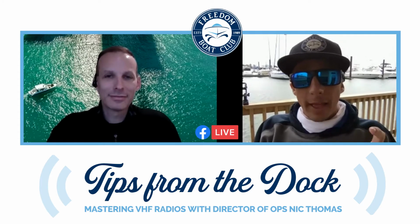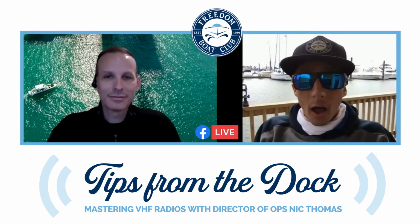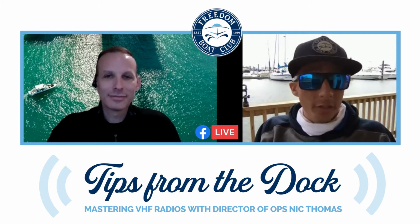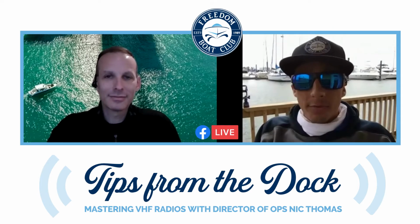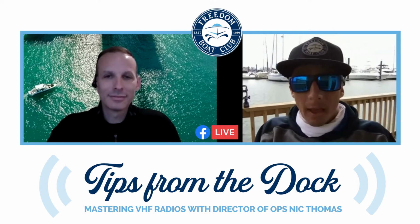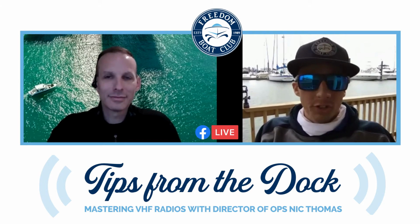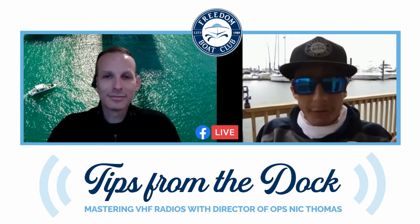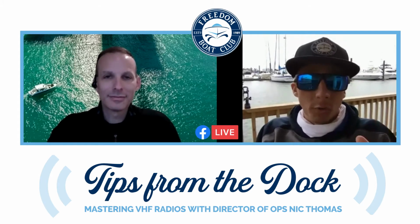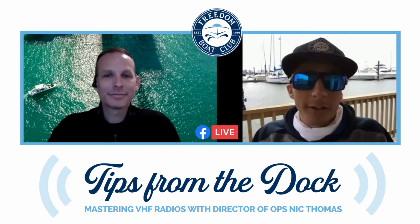So the bits of information you give need to be short, punctual and pertinent to whatever you're broadcasting, right? So you might need to hail another vessel on, let's just say, channel 16. So you say the vessel's name 3 times that you're trying to get a hold of, and your boat's name. And when they respond, you then request appropriately to flip up or go to channel 68 or 71 or 72. And then you guys would go to that channel on your radio and you would have your conversation that you need to. And again, that would be short, professional, but courteous types of communication. So it's just basic VHF radio etiquette.